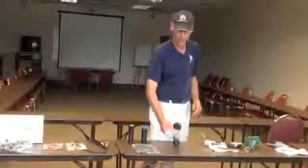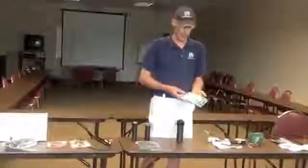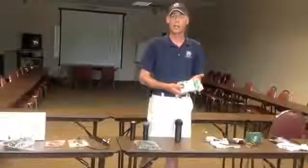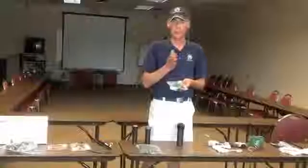There's also a lot of advances in the nozzling of products. This, for example, is Rainbird's He-Van — the high-efficiency variable arc nozzle. It's easily adjustable to all degrees of arc, and because of the high efficiency, it saves about 30% over its predecessor.